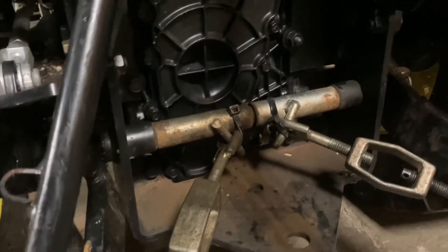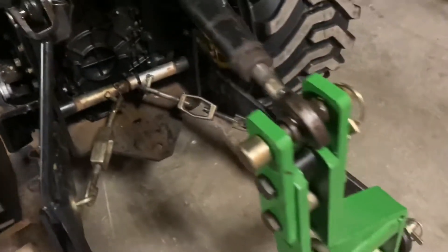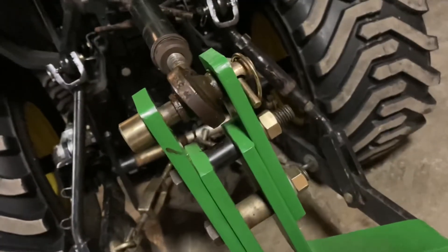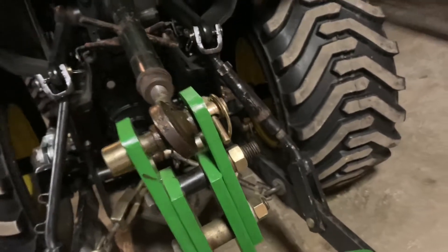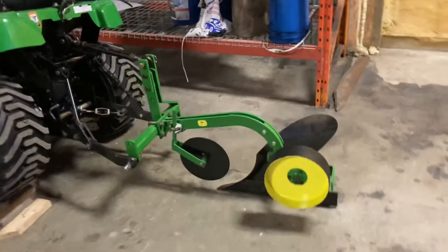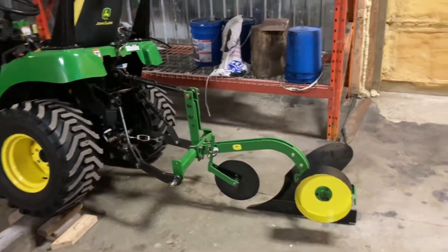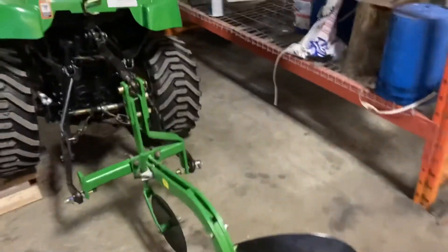It's also a little bit skinnier since it's category zero, so I flipped the tightening links for the three-point hitch so they could tighten a little further. Then I made an extension bracket to fit the category one top link. It's pretty slick — I haven't got it out yet because it's still winter, but I'll post a video of it plowing my garden this spring.